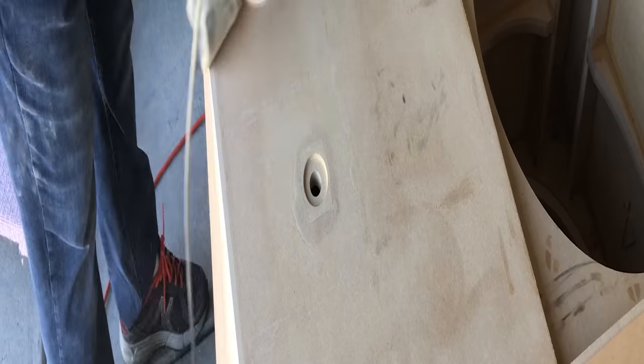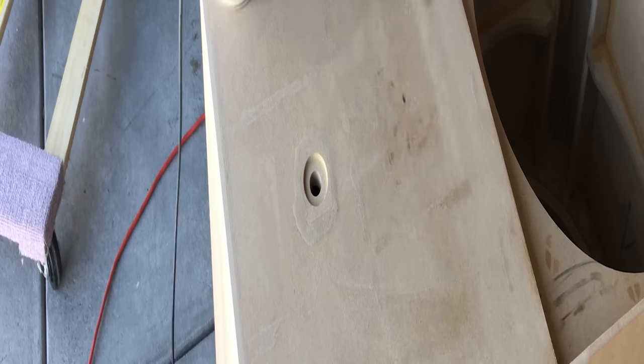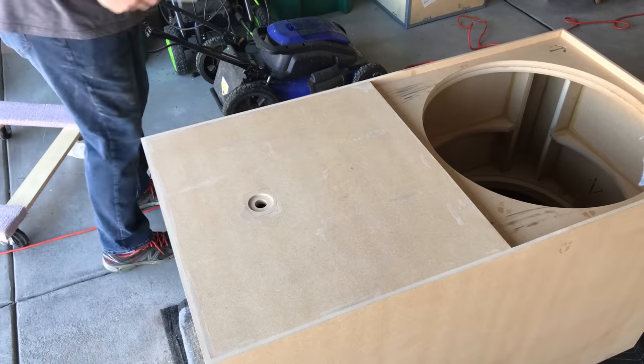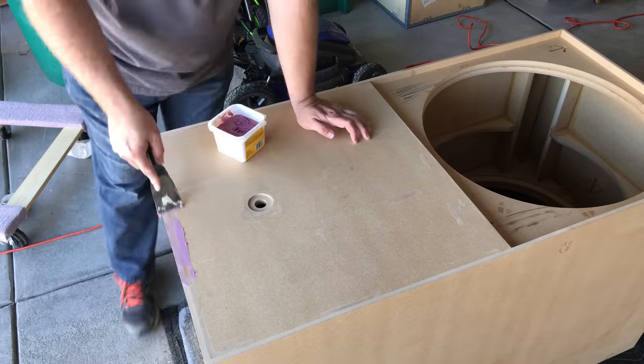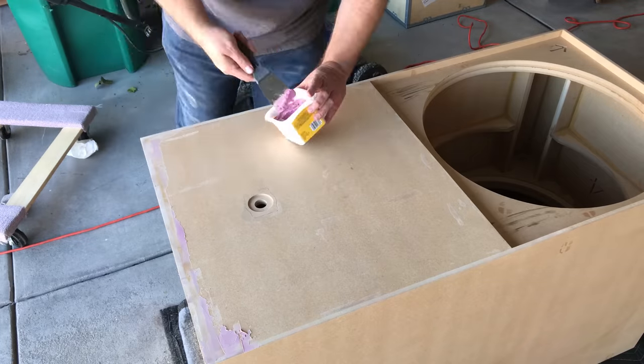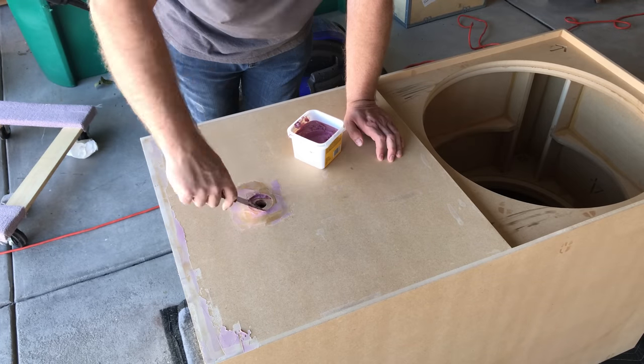And it also kind of helps with paint absorption on those edges if you've got something covering them up. A really good alternative that I didn't use here is to do a glue and water mix on those cut edges of the MDF so that the MDF doesn't absorb so much paint, so it makes it easier to paint. So that's another thing you can do.